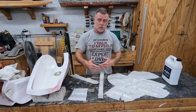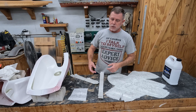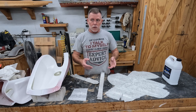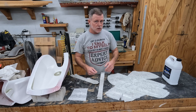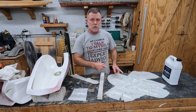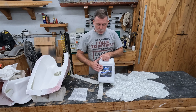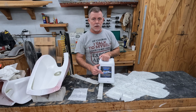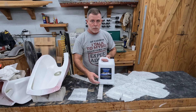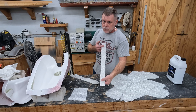Your working time will decrease dramatically depending on how warm your temperatures are, so I do not suggest doing any fiberglass work in direct sunlight. Right now I'm in my shop in the low-to-mid 60s temperature range, so I should get a decent working time. Follow the mixing instructions per the bottle. The brand I typically use is called Fiber Lay — I order it online — and I've used it with success.